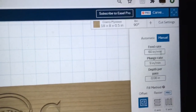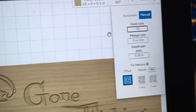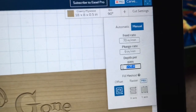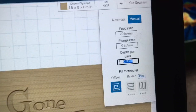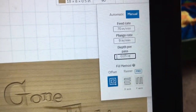As far as the cut settings, I'm going to go ahead and change the cut settings to 70 inches per minute. I'm going to leave the plunge rate the same. Now I'm going at 0.06, so I do want to do two passes, because I want to be able to do a clearing pass to help clean up any fuzz or any problems that I may have. So I'm going to do this at 0.05, and then come back and do a very shallow cut to clean up any little imperfections.